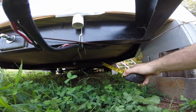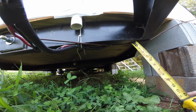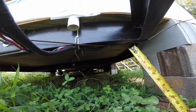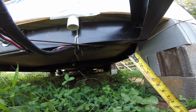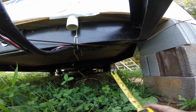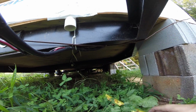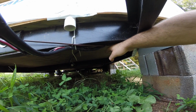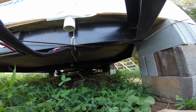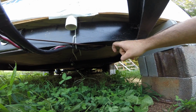So this is pretty difficult to show, but I have an axle down there, and this is the removable hitch. Now this removable hitch I'm going to keep on because I'm pretty confident I'm in a pretty secure location where I'm at right now. I'll just take off my ball hitch. So I want my plumbing to drop below this, and then it needs to go underneath the 2 axles. And if I sight the bottom of these pieces of steel to the axle, I can tell that it's about 2 or 3 inches. So I want the top of my drain pipe to be 2 inches below this steel.